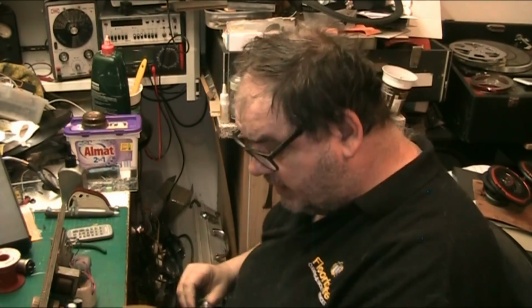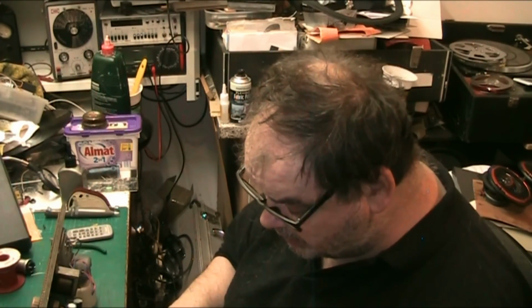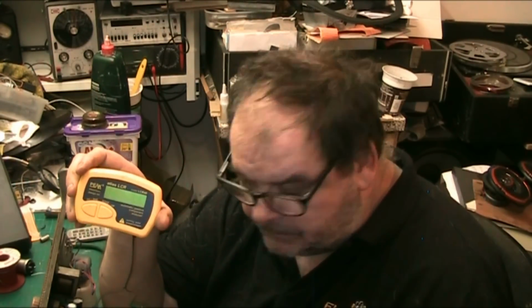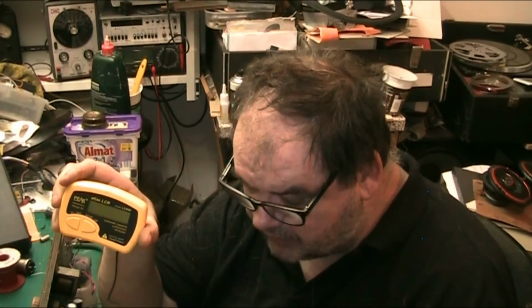That's basically that tester. I also have, I can't get to it right now, but I do have a transistor checker, a semiconductor checker made by the same company, and a thyristor tester. And the semiconductor tester is brilliant. You can test rectifiers, diodes, transistors, pretty much. You can't test ICs, but pretty much anything with 3 legs or 2 legs you can test. Even MOSFETs. You can even test FETs with it.